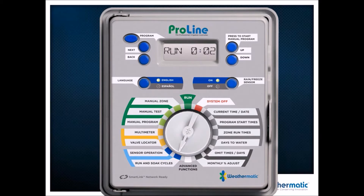Run/Soak allows me to break up that schedule. For spray zones, for instance, everybody knows that after about five minutes the water is running down the street. So I can take that spray head, run it five minutes, let it soak 10 minutes, run it five, let it soak 10. It automatically breaks up that schedule for you. If your irrigation schedule was 20 minutes it would break that up into three automatic start times. It doesn't stop — it goes to the next zone and then comes back to the next available zone, so you still keep your total water window collapsed and very efficient.